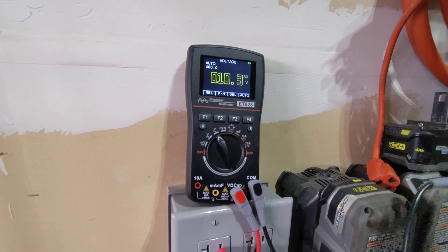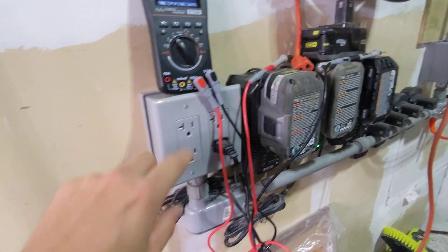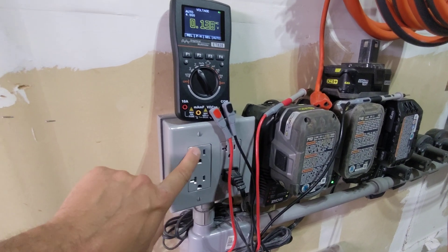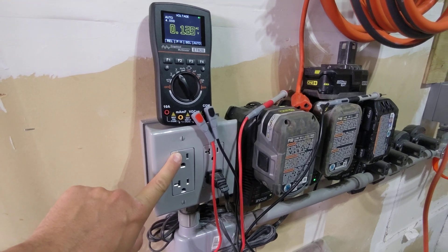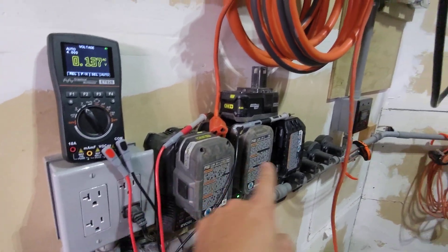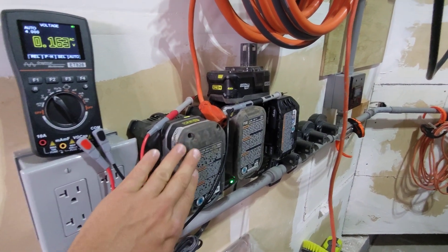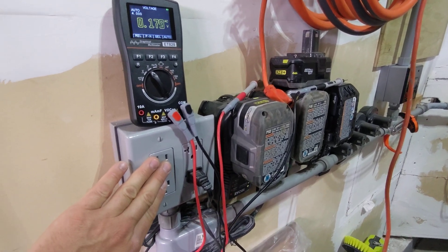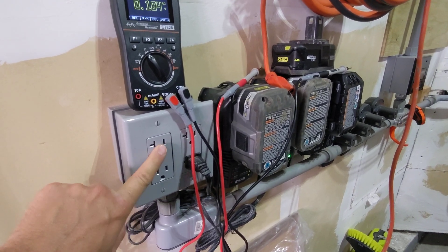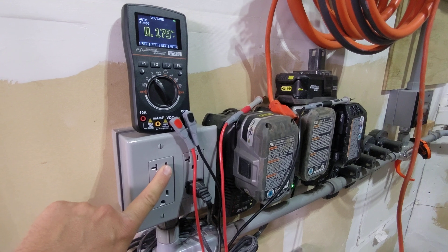So it's not a straightforward yes — you can't just take one receptacle and run both AC300s off it without considering the details. It's like plugging in a vacuum cleaner when everything else on the line is already consuming power — you exceed what the circuit can handle and pop the breaker. I hope that answers the question; if not, let me know and I'll explain further or maybe there's another option I missed.